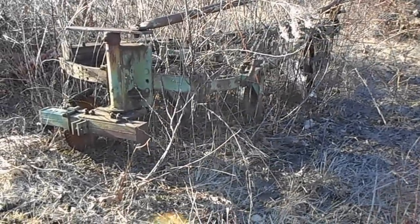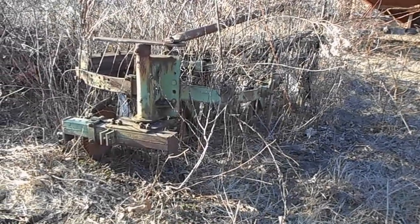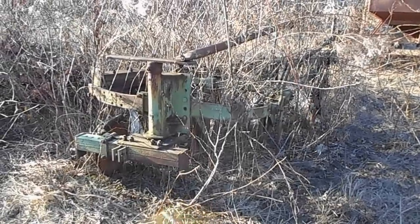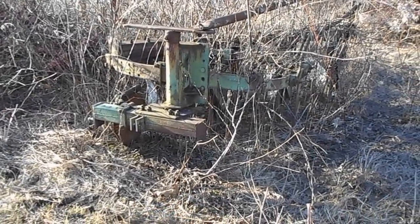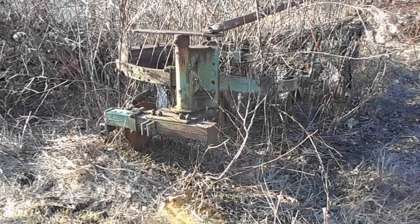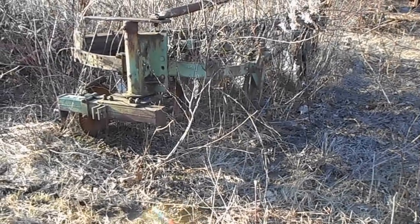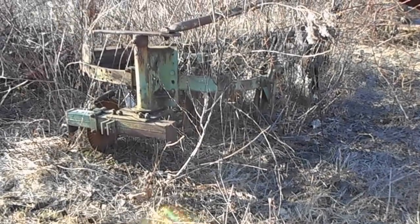This is an Oliver 565 four-bottom plow, bought a couple years ago, and it is as good a plow as you can get. It works fine on Olivers. What I'm going to talk about is draft control and what plow you need for that. Most tractors — Oliver, John Deere, International — are rock shaft controlled draft; they work off the lift arms.